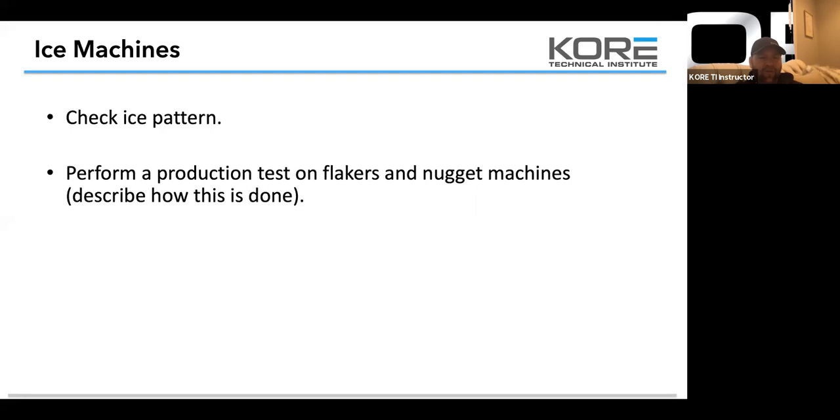So if you guys are having a harvesting issue, you keep going up on an ice machine and you've gone through the charge and you've gone through everything and you cannot for the life of you figure out why you keep icing up, check your water supply temp. If you're even close to 57, it's probably getting colder than that at night.